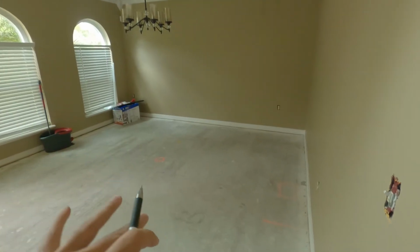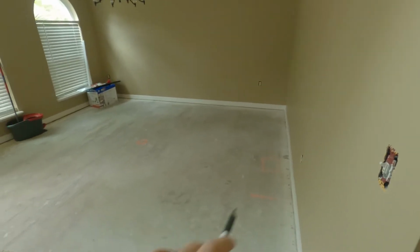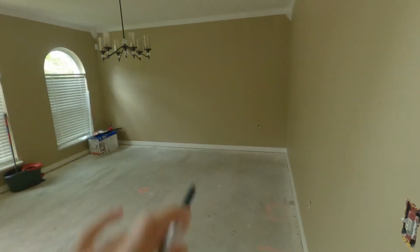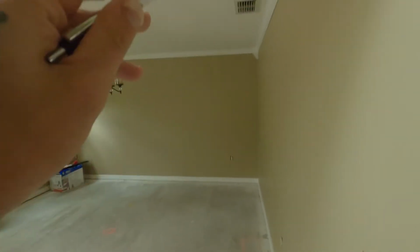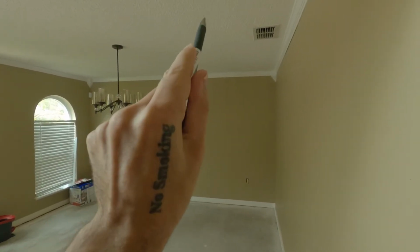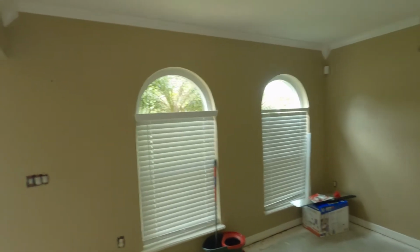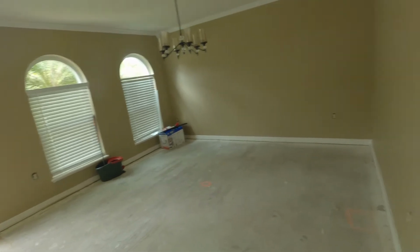But yeah, okay. So the first thing that we're going to do is we have to do everything one room at a time so I don't get chaotic. Here, this lighting here, we're going to measure this room, even though I don't think it matters. What I read for recessed lighting is you're supposed to space them half the distance of the ceiling height. So say the ceiling height is 8 feet, you have to have them 4 feet apart. So 4 feet from the wall, then one, and then 4 feet later put the next one like that. It might not work out perfectly like that, but let's just measure this room. Let's at least get the gym lighting all figured out.